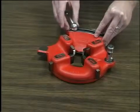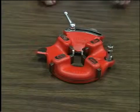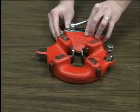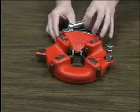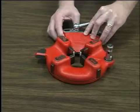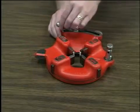Slide the throw-out lever back so that the tongue of the clamp lever washer will drop in the slot under the size bar. Adjust the slide bar until the index line on the link is aligned with the proper size mark on the size bar. Tighten the clamp lever.